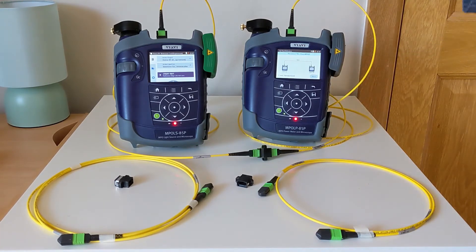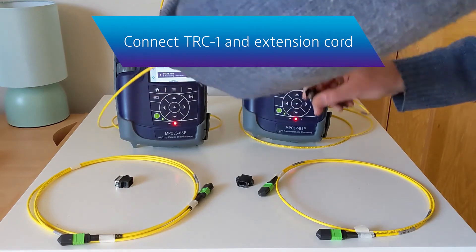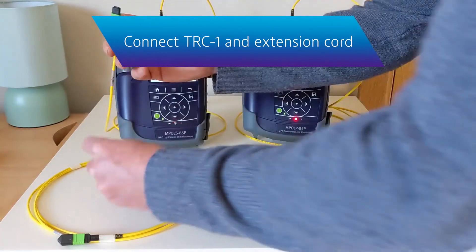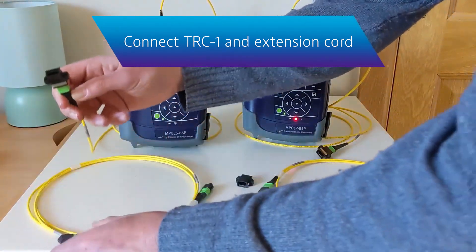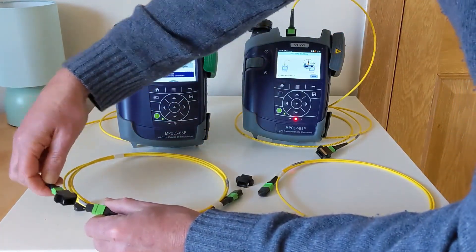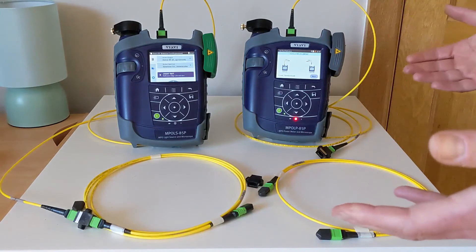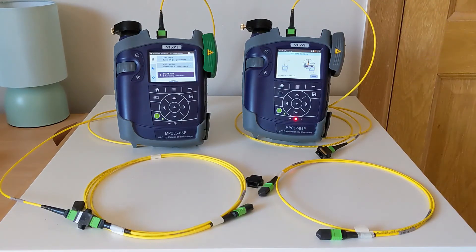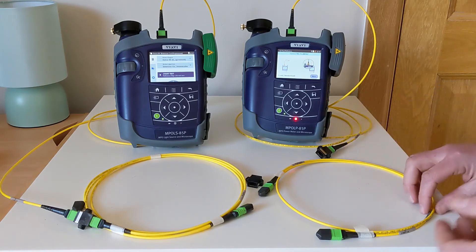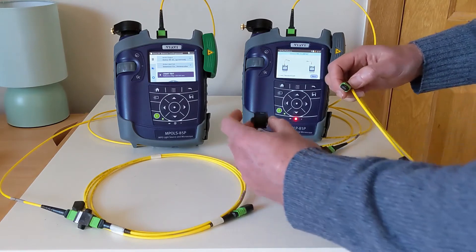Now what we're going to do is disconnect the TRCs from each other, and connect the free end of TRC1 into the extension cord using a reversed key adapter. Now that we've got these three cords connected, we effectively have our test assembly complete, but we want to do another verification test to make sure they are all still good. So here we're taking our unpinned cord and installing it in between TRC1, TRC2, and the extension cord.